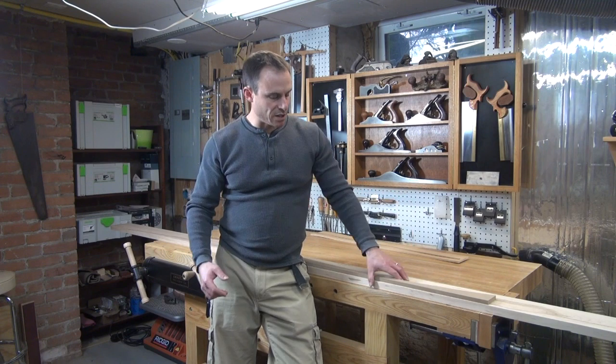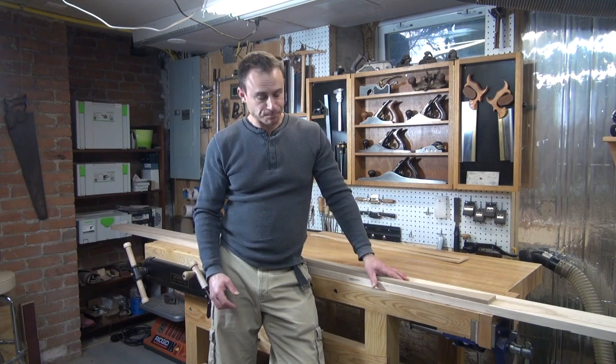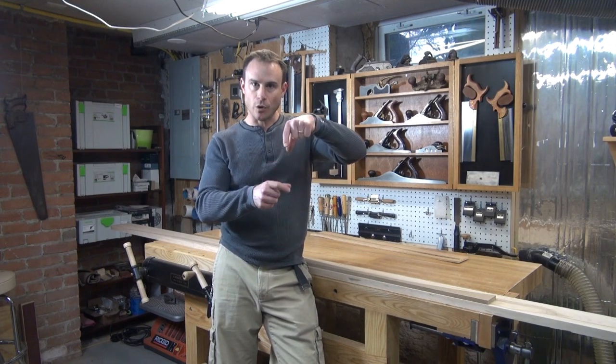So for this apron, I'm actually going to use a different technique called stack lamination. Stack lamination, simply put, is taking multiple pieces, gluing them together to form a bigger piece that you can then use as a substrate. In my case, I'm going to be using some maple that I had kicking around the shop and I will stack pieces of maple one on top of the other until I get a four-inch tall strip that's wide enough for me to cut that curve into the front of it. There are a number of different ways you can sort of lay bricks, so to speak, so you have smaller overlapping pieces. I have a board that's big enough that I can just cut wide strips and then stack them one on top of the other to make up my substrate.